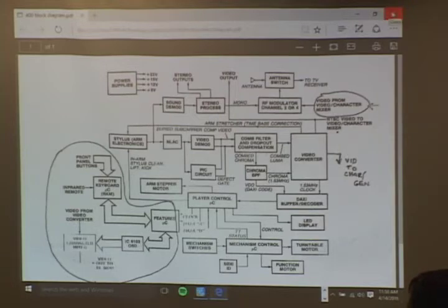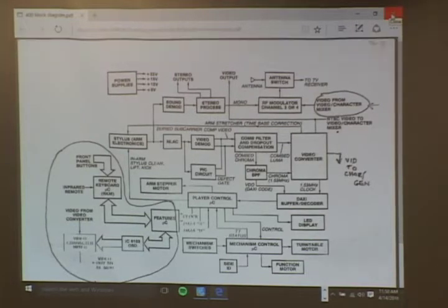You need to be quite good at unsoldering ICs to work on these players. Most electronics are not done this way anymore. They're done by a machine that puts them in. These, in fact, are replaceable. If you want to try it, find a broken player and just start messing with that. You know you're not going to damage anything. It's already dead. It'll teach you how to desolder correctly, and once you see the solder's gone, you can flick the pin off so that you can pull the IC out. That's how I learned. You won't ruin or hurt anything. It's already dead. It's the best way to learn.